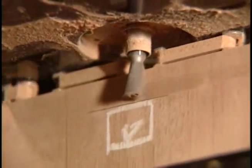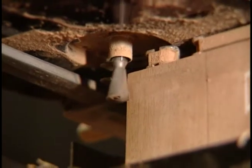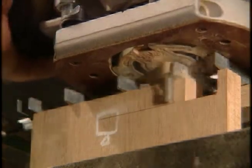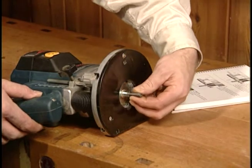On face cuts, whether using a straight cutter or a dovetail cutter, climb routing or back routing will leave a clean edge. But great caution must be exercised in controlling the router's movement from right to left, as the cutter rotation pulls the router in that direction anyway. Here are some tips on how to more safely and effectively steer your router.